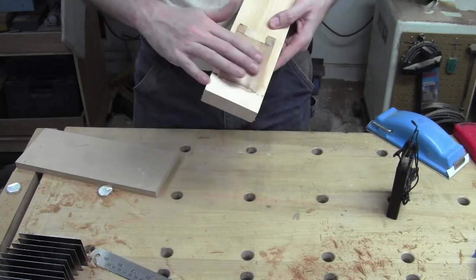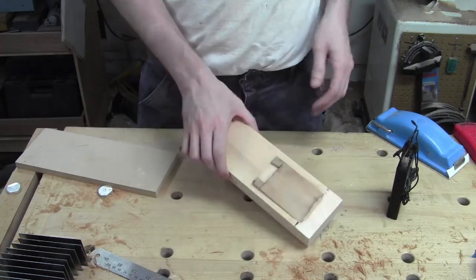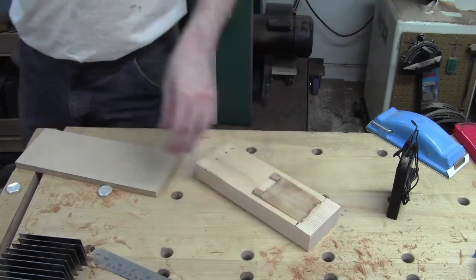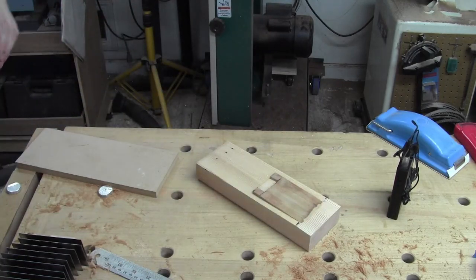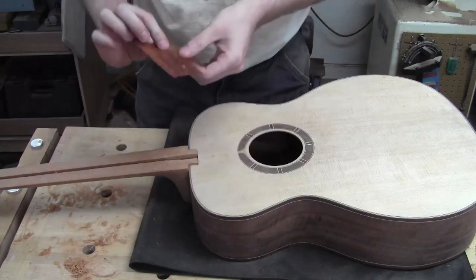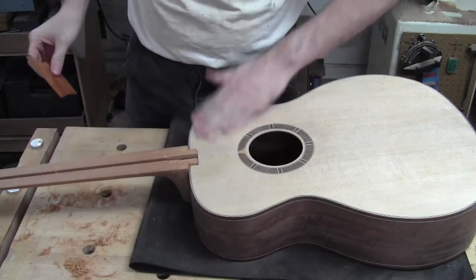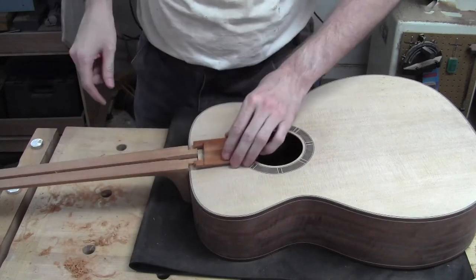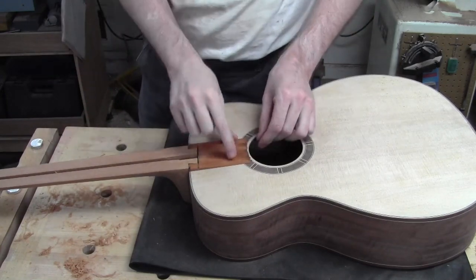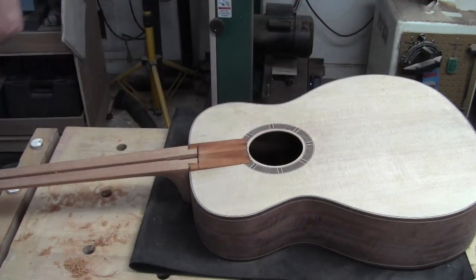What I have to do now is get this off of the double-sided tape without destroying it. We're going to do that with denatured alcohol or mineral spirits or whatever it takes to peel that off. I think denatured alcohol. Alright, so we did that, removed it. It was mineral spirits for this carpet tape that I have. Some adhesives come up with denatured alcohol, some come up with mineral spirits. Mineral spirits took care of that, so I did not have any failure of the wood.